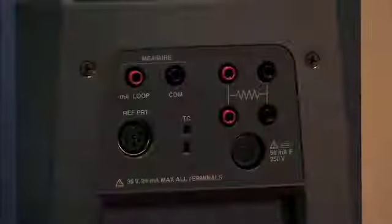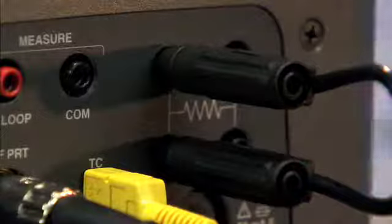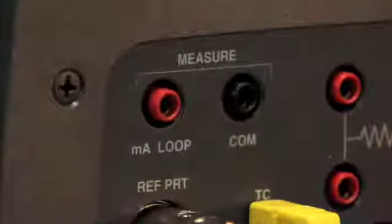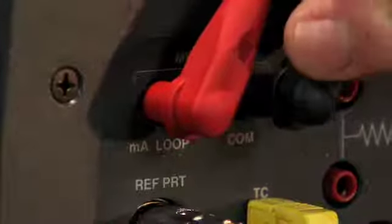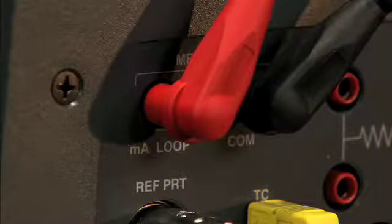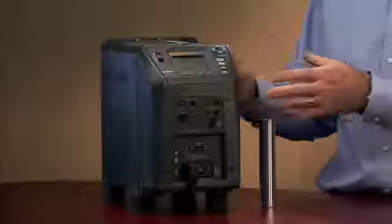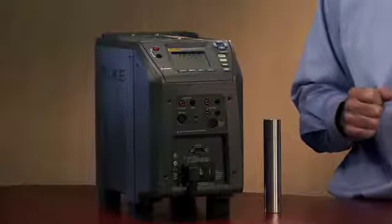In addition, using these buttons here, you can read a two-, three-, or four-wire RTD. You can also use our milliamp measurement to measure a four-to-twenty milliamp transmitter, and source loop current through that transmitter. So with the process electronics, you essentially have a two-channel thermometer readout in one instrument, which reduces the number of tools you'll have to take into the field.